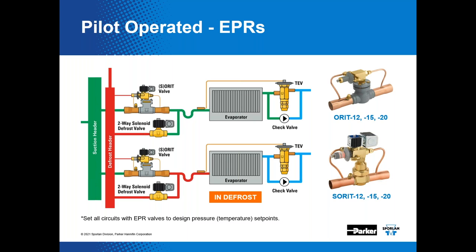Regarding the high-pressure pilot supply source: only refrigerant vapor should be used. The pilot line should be kept as short as possible to minimize refrigerant condensation — liquid in the high-pressure pilot is not desirable. The high-pressure source should be at least 50 PSI greater than the downstream common suction pressure. If used with a gas defrost system, the pilot supply source must be at the same or higher pressure compared to the defrost gas source.